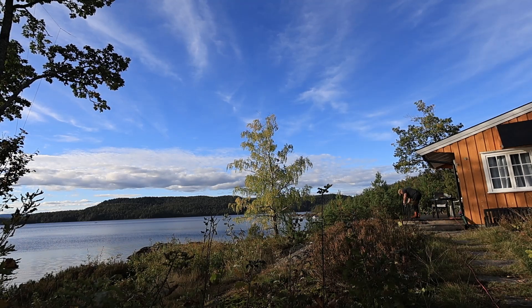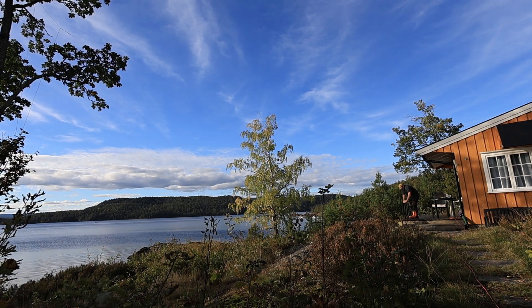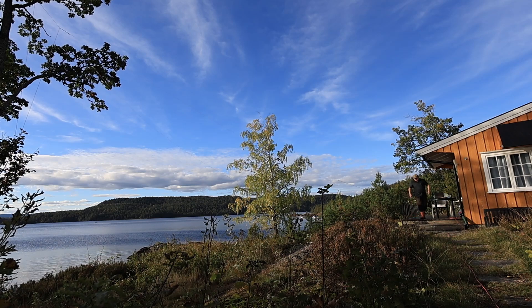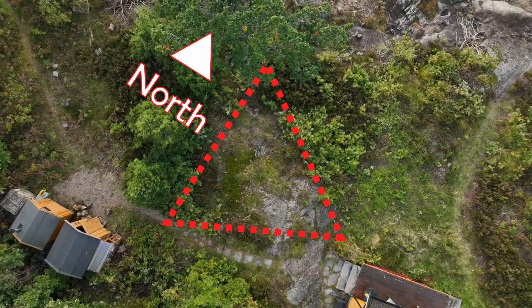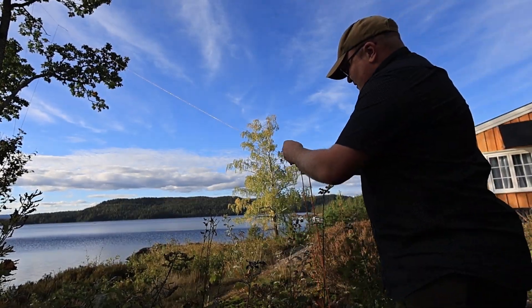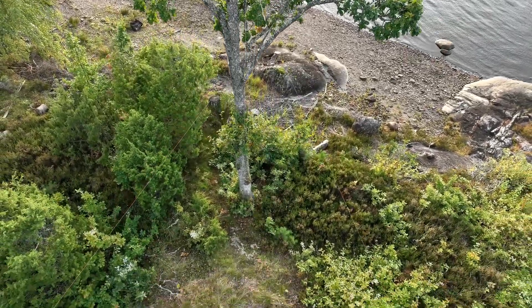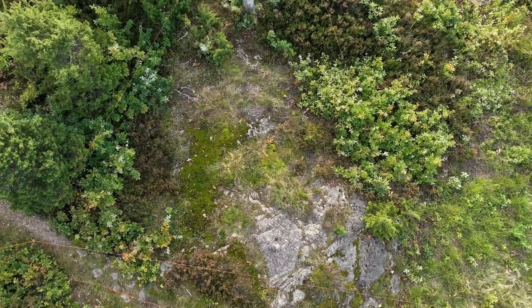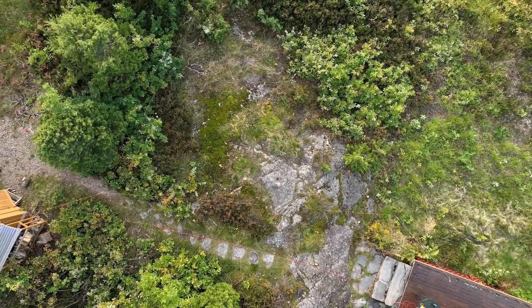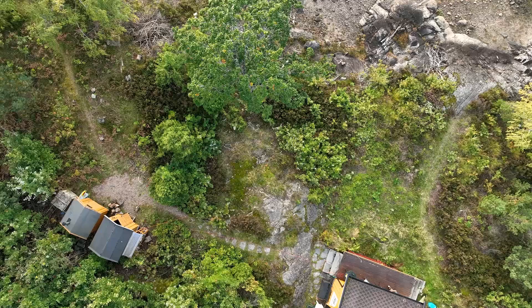Now I'm just gonna tie this off as far as I can get over here with this rope. This is not gonna be a horizontal antenna, but since it's sloping I decided to make it slope southward, which is usually a good way to throw signals. Just another zip tie here — I'm gonna let this be loose so that it adjusts as it wants. So that's my antenna assembled. It's at a roughly 45-degree slope, sloping southwards. If I went with a 20-meter antenna I would probably be able to make this purely vertical with that mounting point, which is good to know.